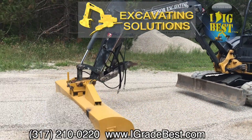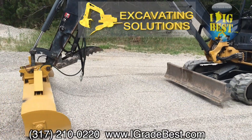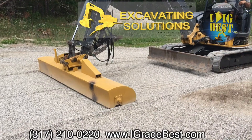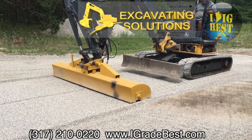This is our iDigBest system running on a mini excavator. You'll see this is gyro-controlled, so as the operator uses it, it automatically tilts the bucket to the right angle. And you'll see when the operator pulls it here, it looks like it's shaking — and it is — but the way the system works, look how perfect it grades out from under it.